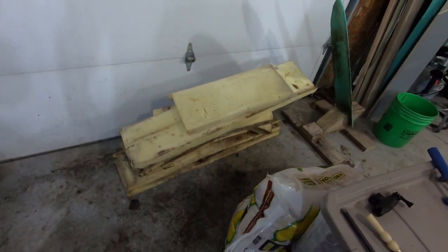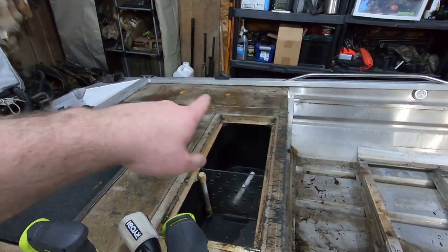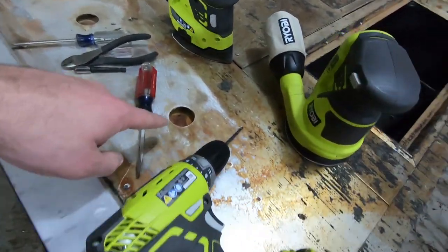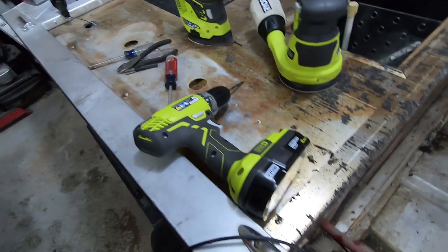Got all the foam out from that compartment and I'm glad I did. Holy cow - that was all just waterlogged, completely saturated. I bet there's 75 pounds of water and foam over there. It should lighten up the boat significantly if it's always been that way. It kind of makes me nervous about the rear because the rear on both sides is completely full. The foam still feels good so I'm not super concerned, but if it's completely saturated halfway up, that could be a significant amount of weight sitting back in here.